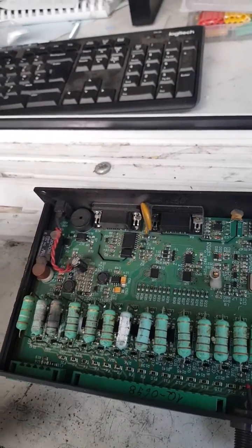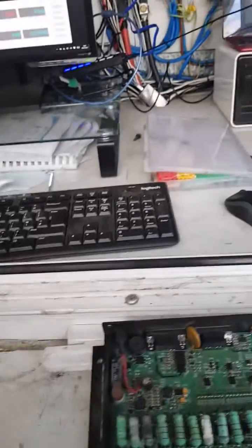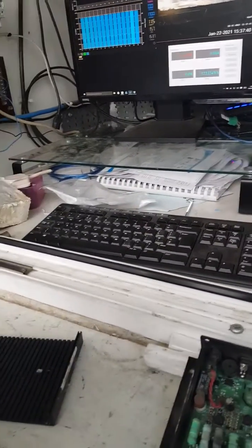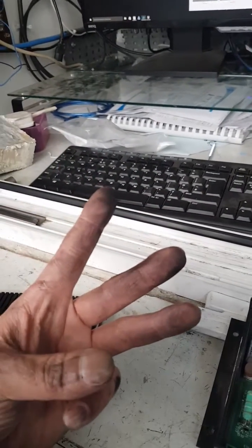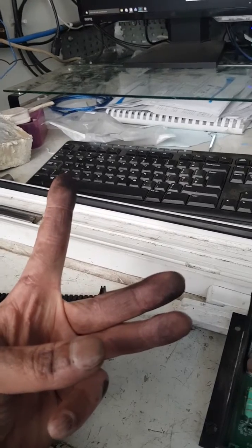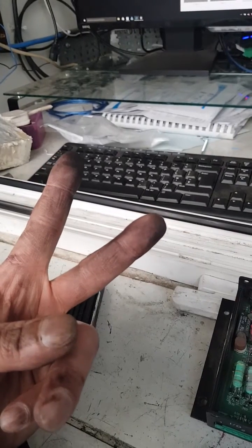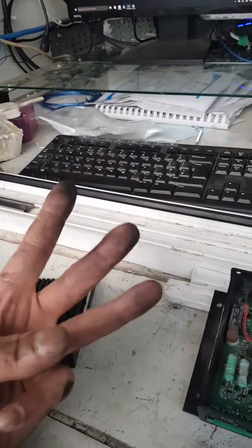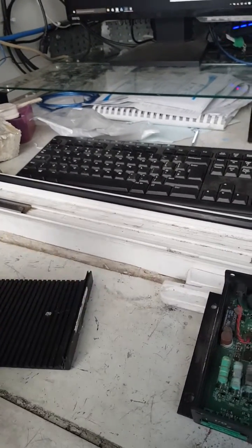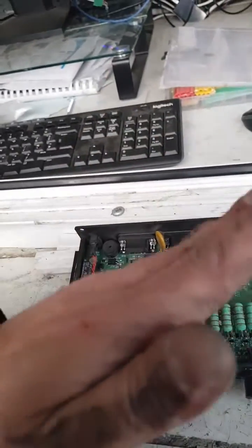The Batrium, from what I can understand, has effectively three settings for charging — and possibly discharge. You've got full charge, which in my case is 170 amps. Then you have something called 'limited,' which brings it down to about 2.8 amps. And then you just have off. So it's not really a fine gradient slope up or down, whereas the REC one will taper that to suit.